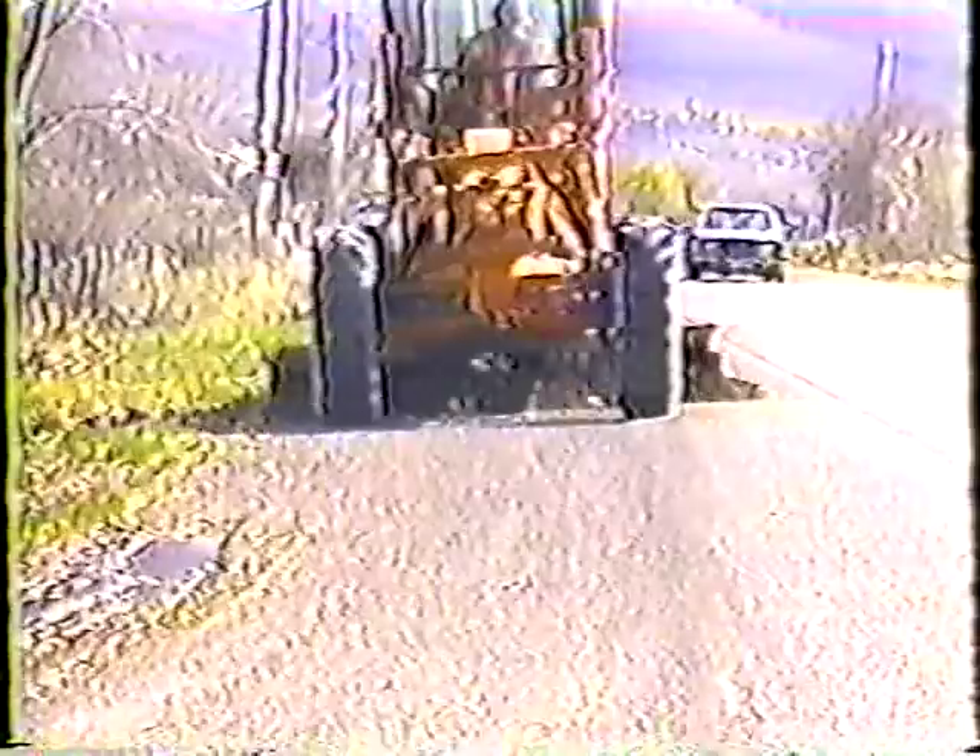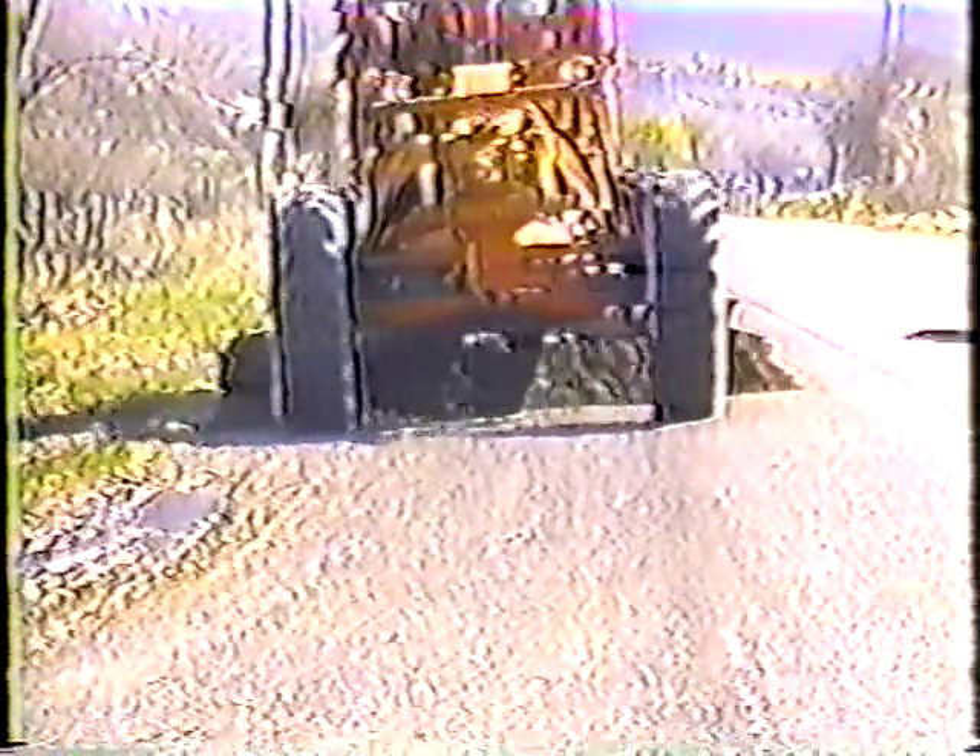And finally, compact the entire shoulder starting at the low side and moving toward the edge of the pavement. Now let's look at the procedure for grading gravel shoulders. The procedure here is pretty much the same as it is for edge rot repair. The main difference is the severity of the problem — the edge rutting here is not nearly as extensive as it was in the last example. So now is the perfect time to repair the shoulder before water has a chance to get under the pavement. Because the damage is minor, many of the steps can be eliminated. All you have to do is pull the shoulder, then spread the material back across it — but be careful to place the windrow right at the edge of the pavement.